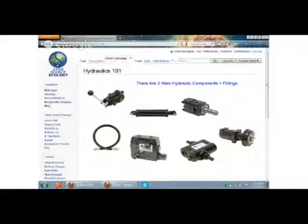We use power cubes, which are modular engine units. Using hydraulics, power cubes, and hydraulic components, we can modularize design completely because power is transferred through hoses.